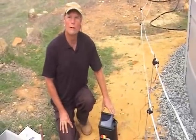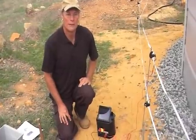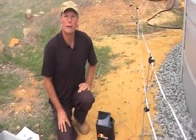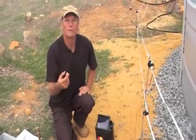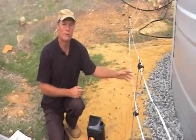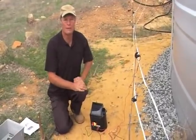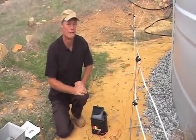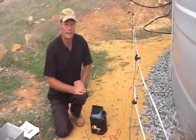This particular unit will do up to a three kilometer fence line. That means it'll do a wire three kilometers long — so if you have one wire, it will do three kilometers. I've got two wires here, so that gives me one and a half kilometers because I'm using two wires. We use it for strip grazing — for sheep, goats, horses, cattle, anything like that is fine.